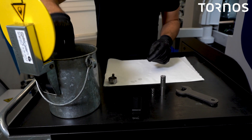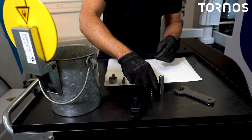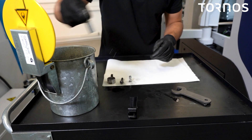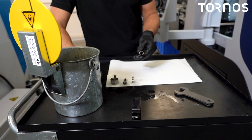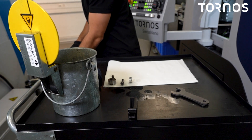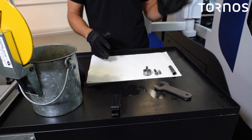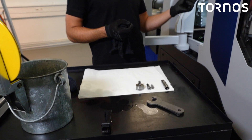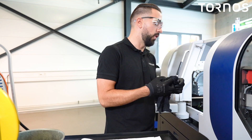Make sure that all the parts are clean to avoid any clamping problems due to dirty parts. Blow all the parts outside of the machine. Before reinstalling all those parts inside the spindle, make sure that there is no metal or dirty material inside the inner of the spindle.